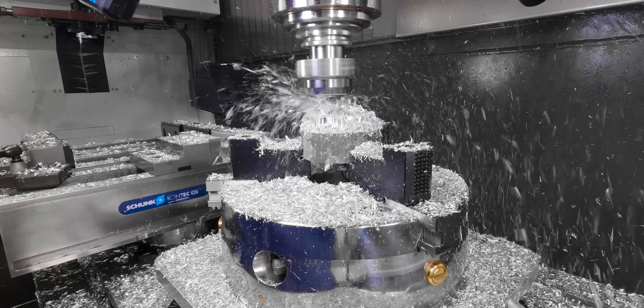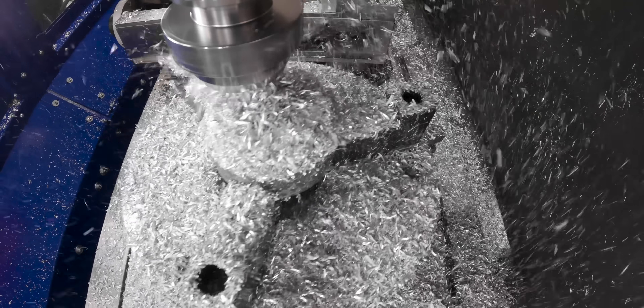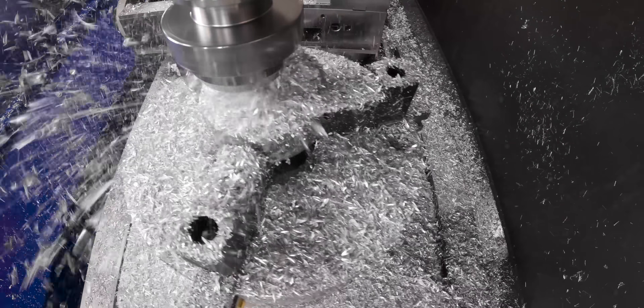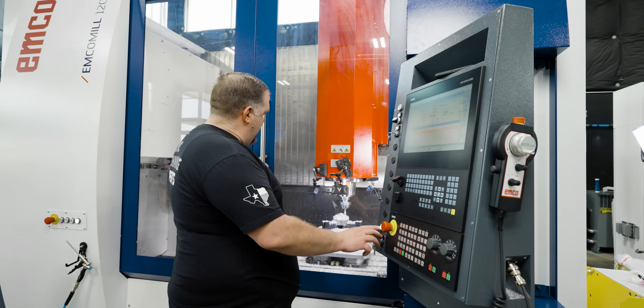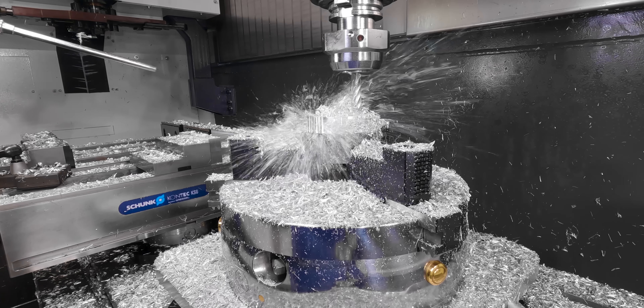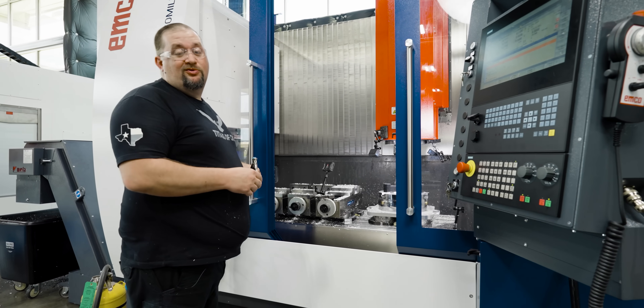This is another non-ideal scenario — we have all these chips building up inside our part, so as the chips are being recut they're getting hotter and hotter. Luckily I know this toolpath is almost done. That was sketchy. So once again we're going to blow our chips off the part, chuck, and table. Less chips equals less fire.